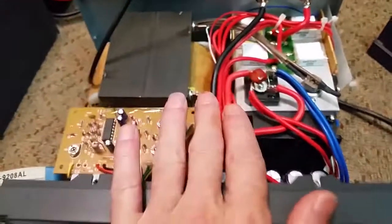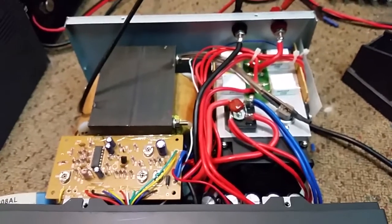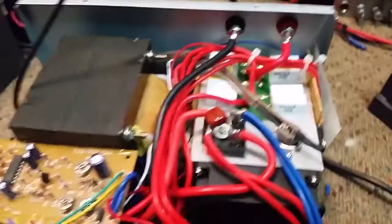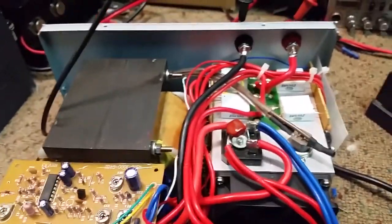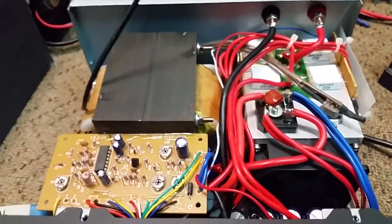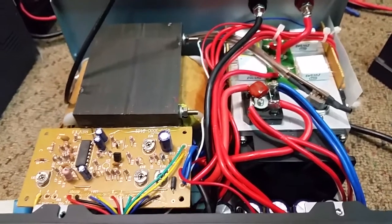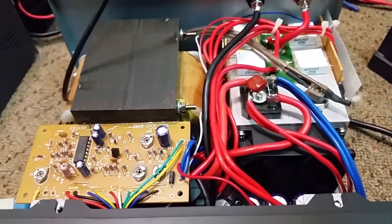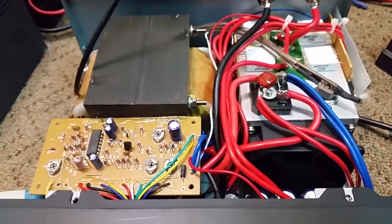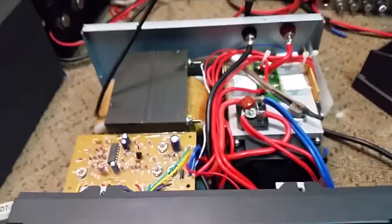That's the only thing I fear about running analog power supplies: these regulators. They have been known to go. And with 90% of the analog, or linear, power supplies, when those regulators go, they usually don't just open up, they short and throw 24 volts straight to your radio. At that point in time, you've really caused some damage.